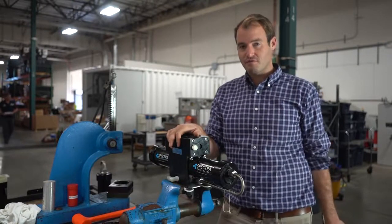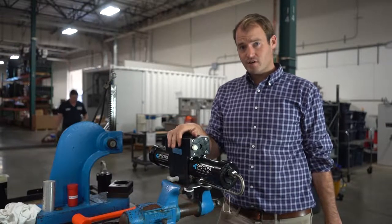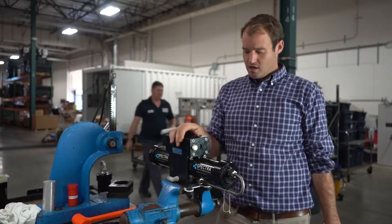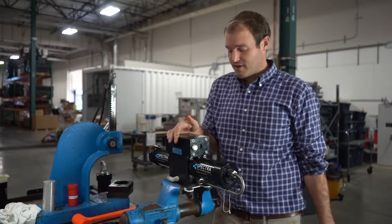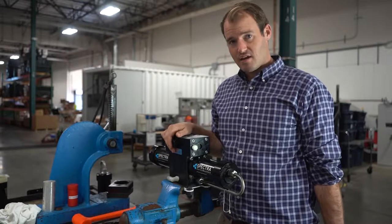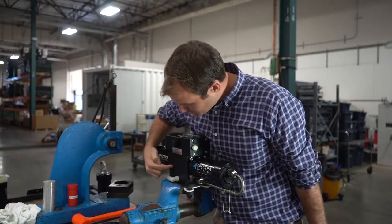The check valve port O-rings are usually the first O-rings to fatigue and cause a leak on your Clark pump from just natural wear and tear. We put a lot of torque on these bolts, so that's expected. People will call in and say they're leaking water out of the bottom of their Clark pump — I've seen videos where there are little bubbles coming out of here.